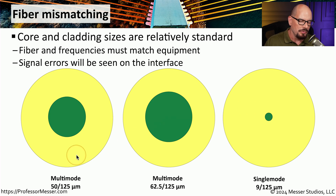In multi-mode fiber, you often find two different sizes: one that is 50 microns and one that is 62.5 microns. There is also cladding around that which makes the total size of the fiber 125 microns, which is identical if you were to hold them in your hand. Single-mode fiber is very different — it is around 9 microns — but still has cladding around the outside that brings it up to 125 microns.